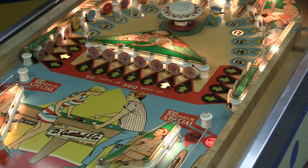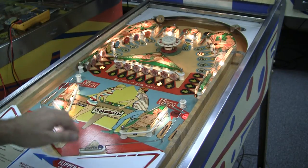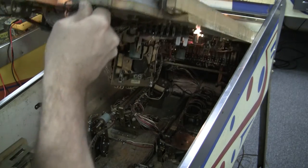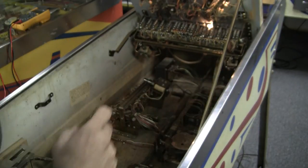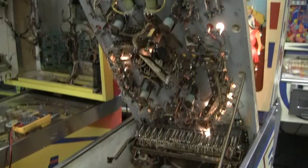So we're going to take the ball out of the machine and show you what's going on. I'm going to have to pull the thing up while the game is on. This is also a little way of showing you how you can manipulate these old EM games without the ball and take them through their paces. I'm not a huge fan of messing with games while they're turned on. You gotta pull the plunger back to lift the playfield up. I'll lift this up very carefully — do not want to touch anything metal. Alright, there we go. Playfield is up, game is actually in play mode.